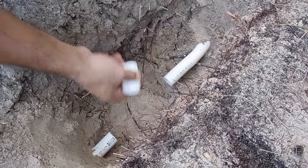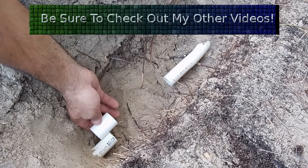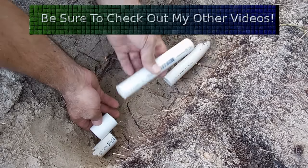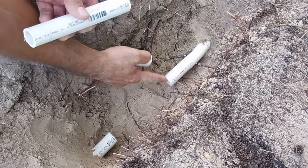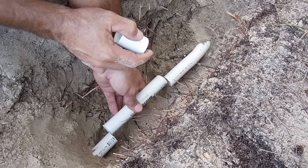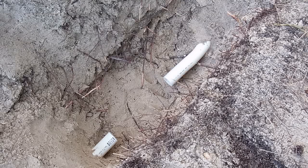Take a coupling, glue it onto the pipe that you cut, and push it all the way down until it meets the stop. Take a new section of pipe that's not damaged and measure it so that when it goes into the other pipe it ends up flush, or with just a little bit of room for you to slide the pipe in and out. Before you glue, use a slow-setting PVC cement for this job. Regular setting cement will work fine, but do not use fast-setting cement — if you use fast setting you may screw up the repair. Regular or slow setting PVC cement is ideal.